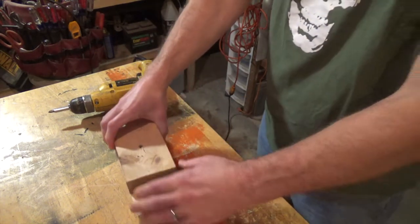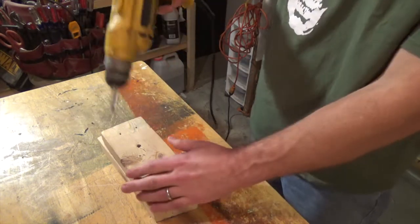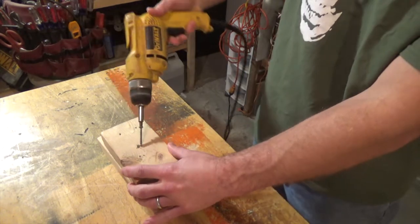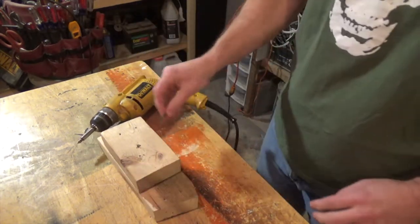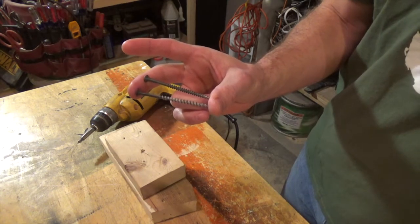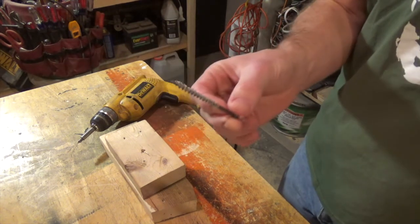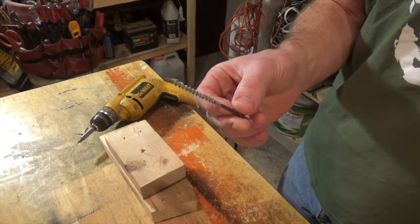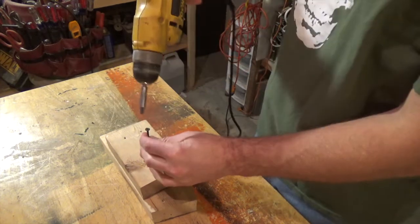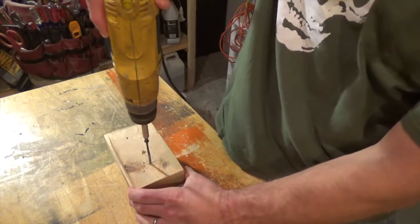It absolutely makes a ton of difference. Now where this is a real game changer is on projects that require routine maintenance, like billiard tables that we would have to refelt from time to time. If you ever have to come back to the same table, the screw comes out a lot easier because of the beeswax. Many times we would find ourselves driving long screws into non-pre-drilled holes in the billiard tables. The beeswax on the threads helps condition the holes as the screws go in and assists in preventing the wood from splitting. This is extremely helpful when you're drilling screws in the blind spots where you may not be able to immediately check the integrity of the wood.